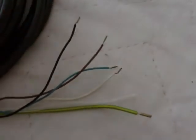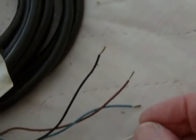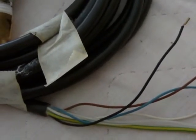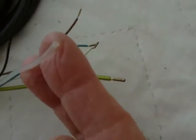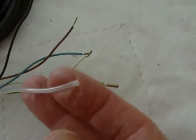It has a brown wire to apply power. It has a blue wire return. It has a white wire for the current output. And it has a black wire for the switch. Then this white thing is not a wire — it's actually a plastic tube. It's the return, or the reference, for a gauge pressure device. This happens to be the 60 PSI one.